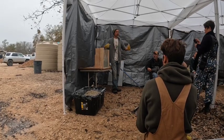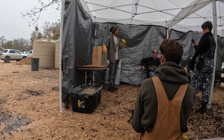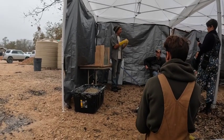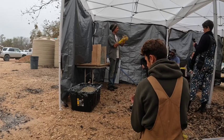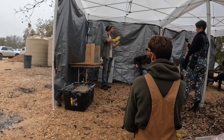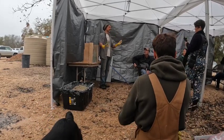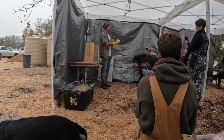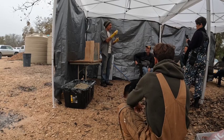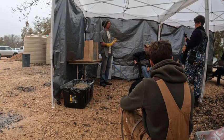This is a wall infill system, and we're going to plaster it in the end, so there is some forgiveness. We can come in with the plaster, and we can even grind the hemp down into a finer hemp and mix that with the plaster. With just a lime plaster, you could maybe build it up an inch in a few layers, like the first quarter inch dry, and then build up another one. But if you have a bigger cavity, maybe 3 or 4 inches deep, you can use a mix of the lime plaster with some hemp hurd in there, the smaller fines, the smaller pieces, and then you can build up your plaster a little bit more.